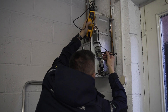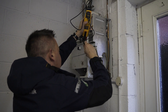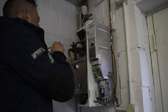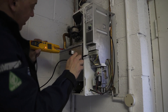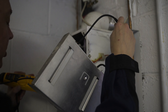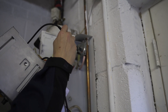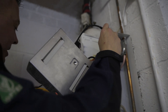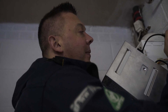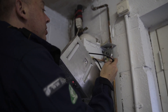You've got a switch back from your boiler, then a live that goes out to your pump when there's a demand on. It's been a while since I've been looking at these boilers but they don't ever really change. We've checked that, and should have a live there which we've got. Currently showing four volts. I'm certain looking at this that that's just a low voltage switch. It is switching across because we are getting through it, but it's very low AC voltage. I don't know if that should be higher.